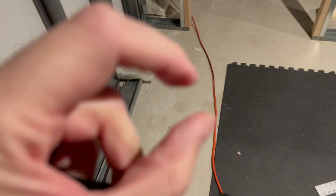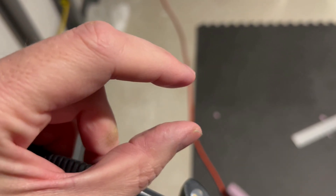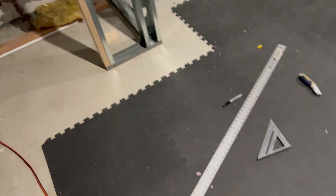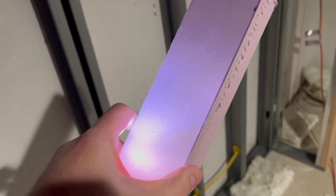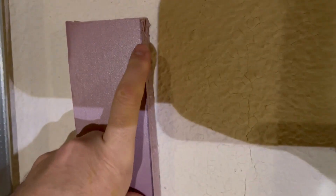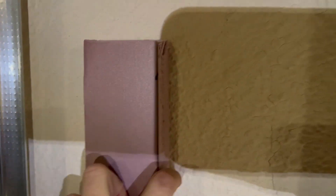You spray a little bit in there and it expands quite a bit — when it first comes out of the can you think you really need to spray a lot in there because you're trying to fill an inch and a half. They actually make two-inch foam board which a lot of people use, but I went with one-and-a-half-inch. You put this against your joist and spray, but I had a tendency to think I need to fill that whole space all the way back — I don't think you need to, because it expands a lot.